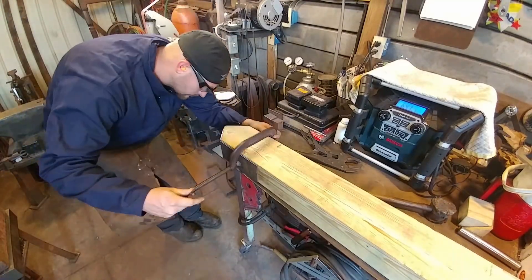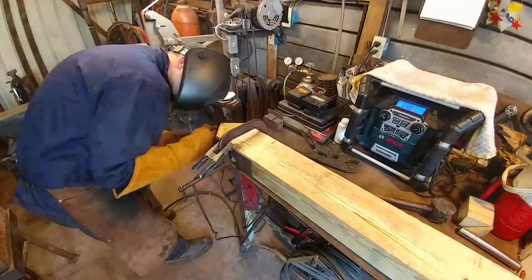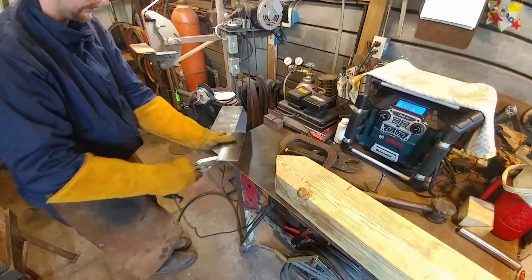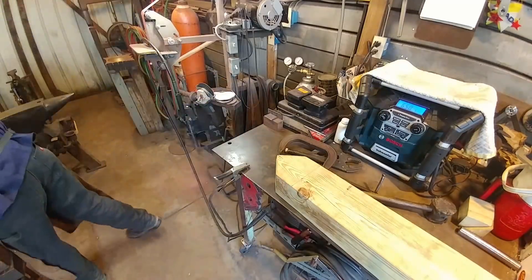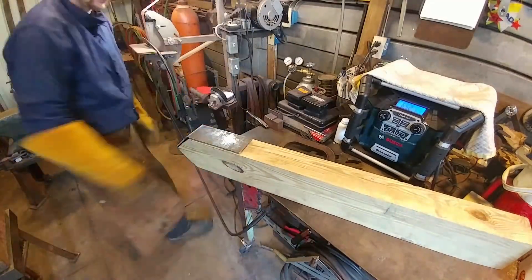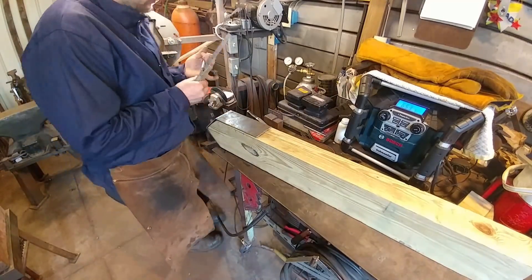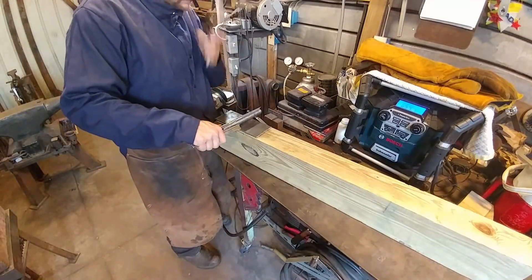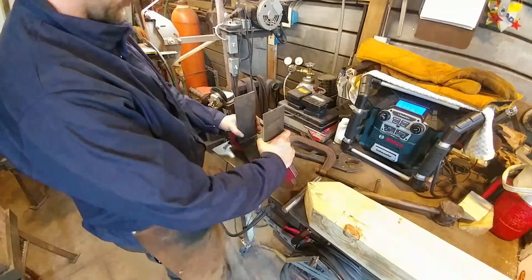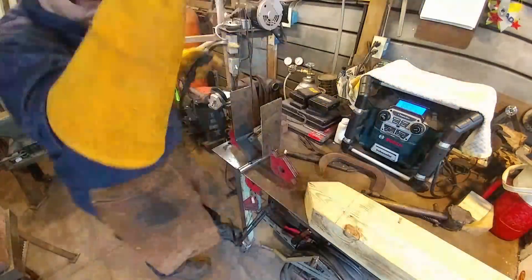What I'm working on right now is the hinge plate — the part that's going to make the hammer arm, or handle, of the beam hammer pivot. I took an angle grinder and cut a groove on a mark I had previously made, so I could bend these at exact angles. Then I welded up that valley that was created after they were put in the correct position. This is a clean way of making a nice accurate breakpoint.